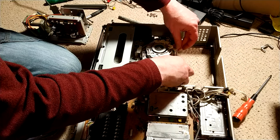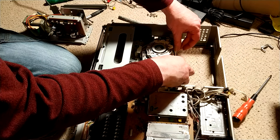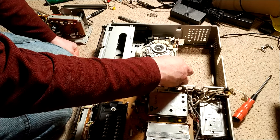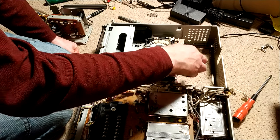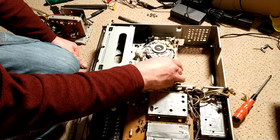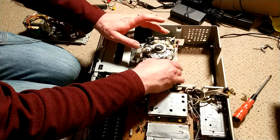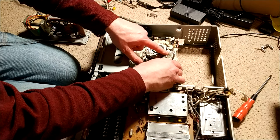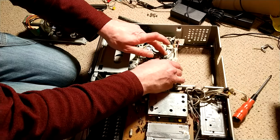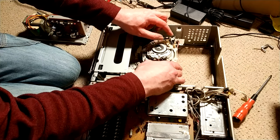But I did notice that when I was using the old ring, there was some resistance around here, like this was bent. So I had a spare one of these, so I've put that on, so it's uniform all the way around. So you can see that's working pretty well. What else happened? I've taken the upper drum off. I didn't show that on the video section where I'm taking all this apart. I've taken this off and given it a good clean. I've aligned these as well, which I've done off camera.